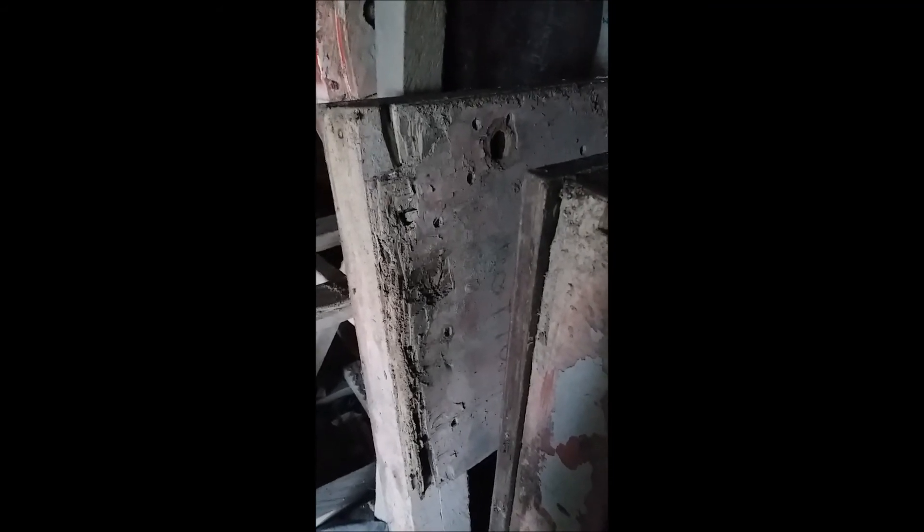Those things that look like nail holes are torx head screws. As you look around the bolt hole, you can see they're on a diagonal. The other screw hole was there to patch some delaminated phenolic board, which is pretty well bad on this one. They're on a diagonal so that if you take the phenolic board off and change it, you can run screws the other diagonal way. We drill the facings then just put them up and run the screws into the framework — that gives you two shots where the screws won't hit each other.